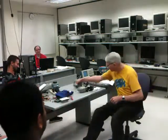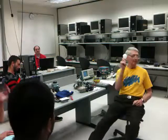Okay, so nowadays you have more efficient generators. So let's say we got away from hamsters in a wheel. Let's say there's a generator on your bicycle and you're gonna pedal to keep this light globe bright. That's gonna take a little effort, right? 100 watts, you're gonna keep it full bright for 1 hour. What does Rocky Mountain Power call that, when you keep this 100 watt bulb on for 1 hour? It's 0.1 kilowatt hours.